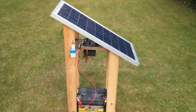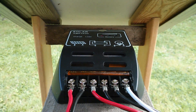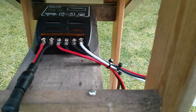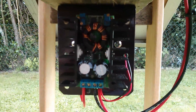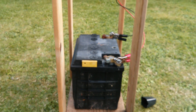So that is it. There is the monster bright 30 watt garden solar light, just now waiting for dark. How about one final look at the wiring. We've got the solar panel cable going in on the first two connections, battery going in on the middle two, and the daylight switch going in on the load side. On the LED block we've got the boost converter input with the fan wires and then the output going to the LED. These two wires come down to the battery and that is it.